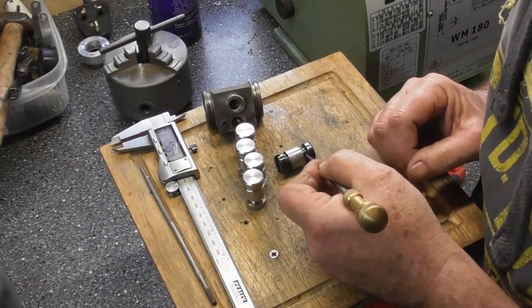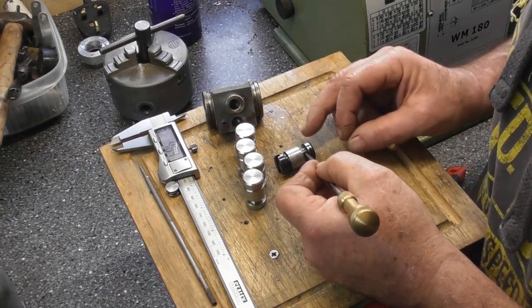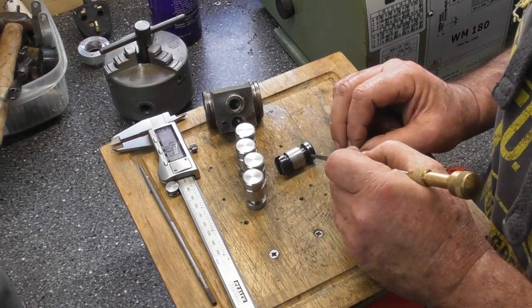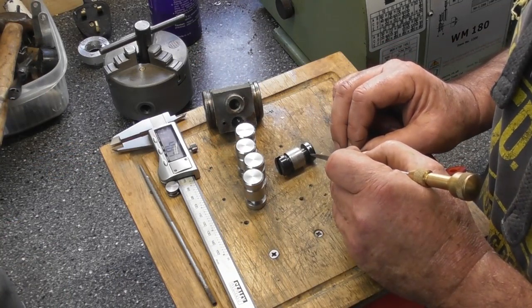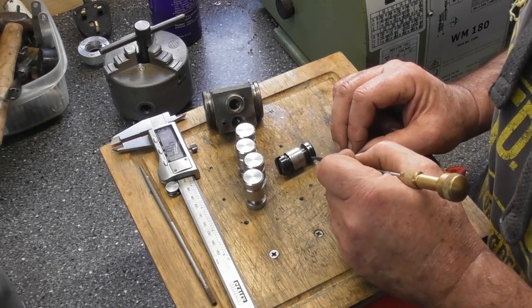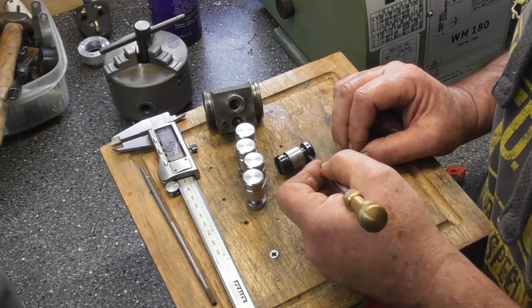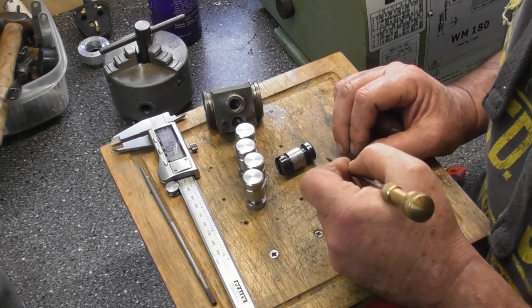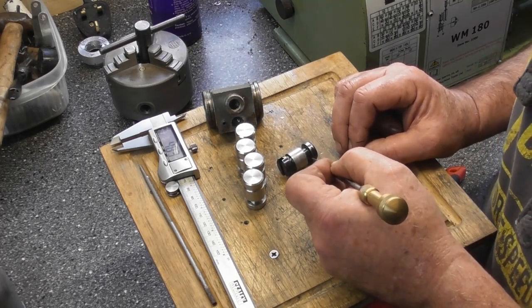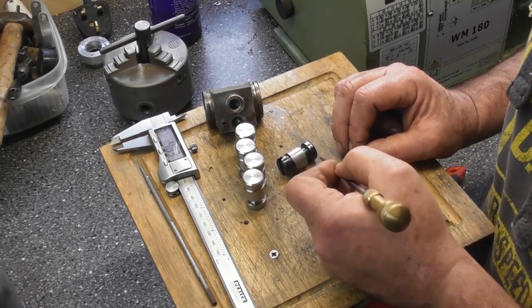I nearly forgot I need to put a taper on this face here, tapering out from the base at 10.5mm diameter out to the top, with the top becoming half a millimetre further back because this slot measures five and a half millimetres at the bottom and six millimetres at the top. I did a quick calculation and it's approximately eight degrees, so I've still got the compound up on the lathe and I've still got a collet chuck in, so we're going to have to look at machining these at eight degrees.